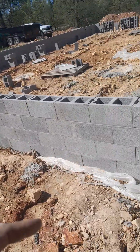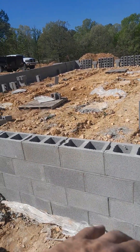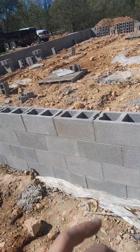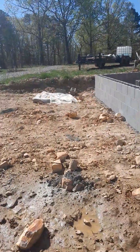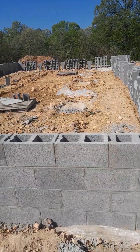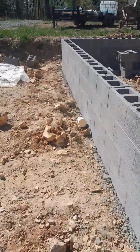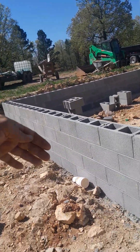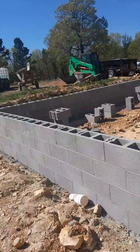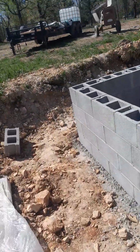They like all their stuff struck. When you strike it, that's where you take the tool and go in between the joints. When I used to do it, we always used to float everything — that's where you take it all perfectly flat, take your sponge to it, and you're washing the wall pretty much. But when you get good at it, striking is a little bit quicker and easier than floating, because floating is just a pain in the ass either way. When the sun's hitting it at this angle you can see the quality of the block — any flaw will pop out. But striking does hide the flaws better than flat floating it.